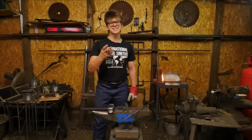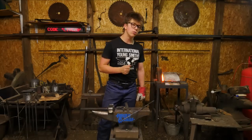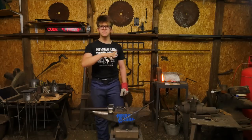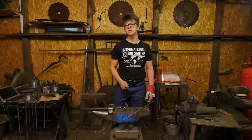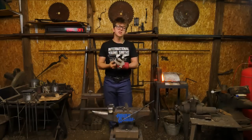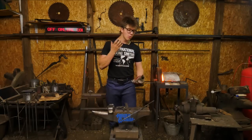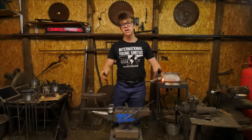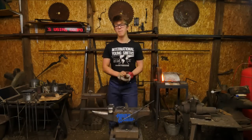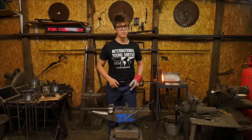So there is less stress placed in the hole. Of course, if you were to use a fuller where there's much larger surface area contact, much more energy being dissipated through into the anvil due to the greater resistance of the material thanks to the larger surface area contact, you would end up wedging that thing in there with such a tremendous amount of force, you might well break your heel. But the hot cut is used for cutting hot steel.